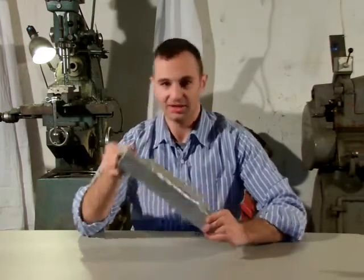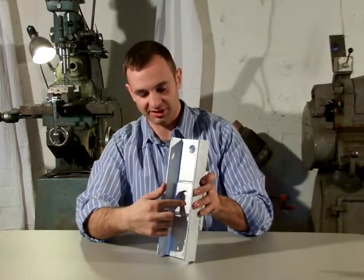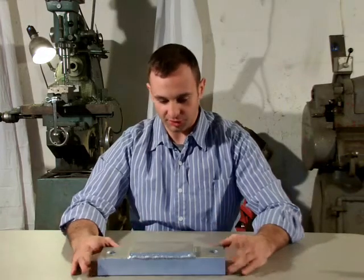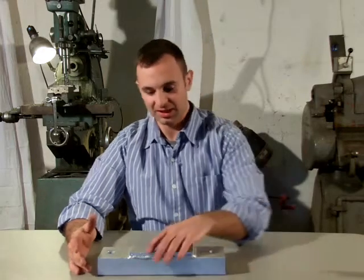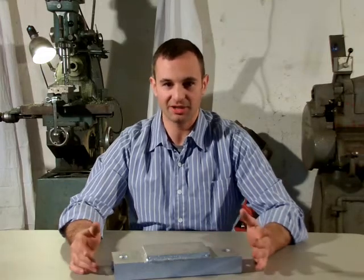Another feature of our machine is the steel trusses that you can see here. You can see there's a standard channel and a standard plate welded to the channel, and there are also some gussets in the middle. The frame is constructed out of these members. They're similar in design, but not quite the same. This way the machine can be constructed very inexpensively and be very lightweight, because a cast iron equivalent of something like this would be about 5 times the weight and probably about 3 times the cost.